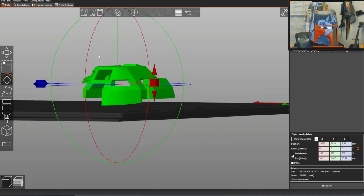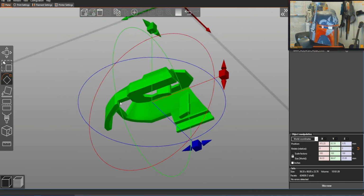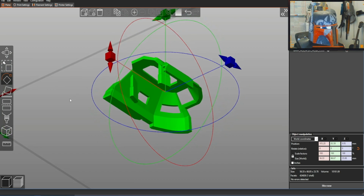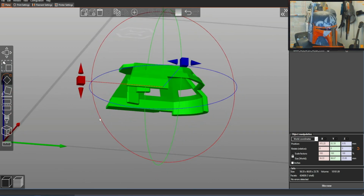And maybe, yeah, we can't even really get this down. So we're going to have to put supports all along this edge, all along this edge. Now we could space them out because of bridging. If you don't know what bridging is, it's your printer's ability to cross an open space without drooping.